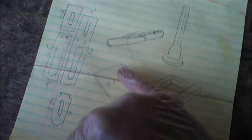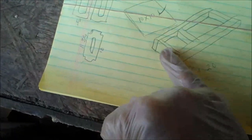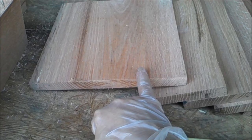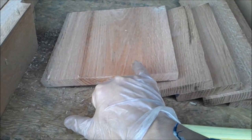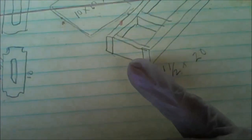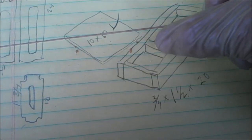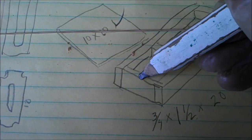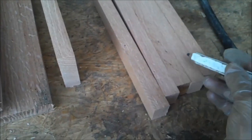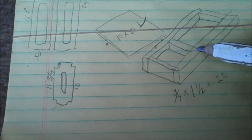We got two of these, and we have two of these long ones. Let's talk about dimensions. This turned out to be — these were planed down to seven-eighths and they're actually pretty thick, one and a half inches wide here. These are 24 inches long; I went ahead and made them 24 to give us a little more leverage out there on the end. So we got two of the outside and three braces. The length of these I measured by putting two of these boards onto my board and then marking it to what it wants to be — to be the same as the width of this. It's going to hold 10 inches from this outer corner to this outer corner, with three bracings that'll go in the middle.